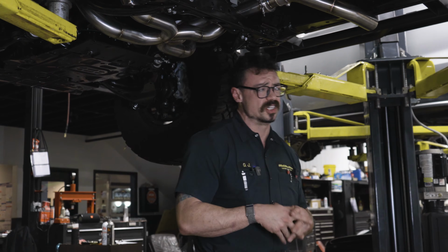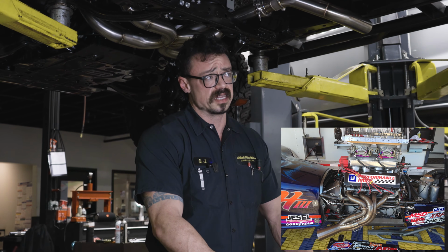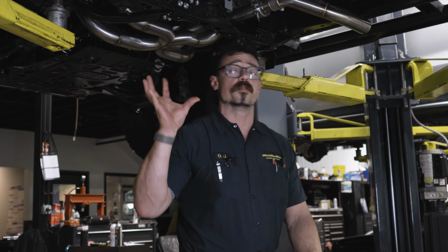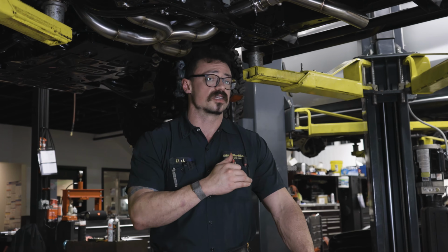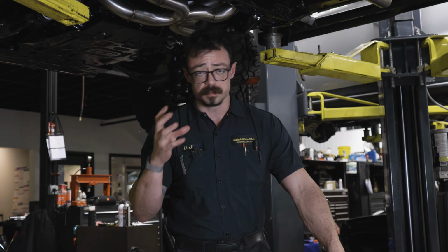And then you have other things like, how loud does this thing have to be? How does it look? What does it sound like? You know, we get into all these features, which are really just personal taste at that point. I mean, even if you're building an exhaust for, let's just say, function, right? And let's say that function is performance. Like I just said, your performance is going to base on what you're dealing with, where you're packaging this thing, hugging to the frame rail, not being too close, being away from other things that could melt, and also having that piping deal with those obstacles while still making performance, still making the most power.